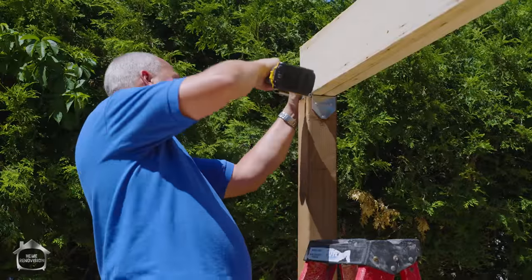All I do — measure from the ground to 11 and a quarter. Remember, all of this gets covered by sheathing. If the height from the ground to that mark is the same difference as the difference between the two post heights, and these are level, it's now a parallelogram. So I put a screw right off the corner, take my lumber, set it on the corner where the post is, rest it on the screw, and simply trace that angle from the backside. That's it — now I've got the same angle on the front.